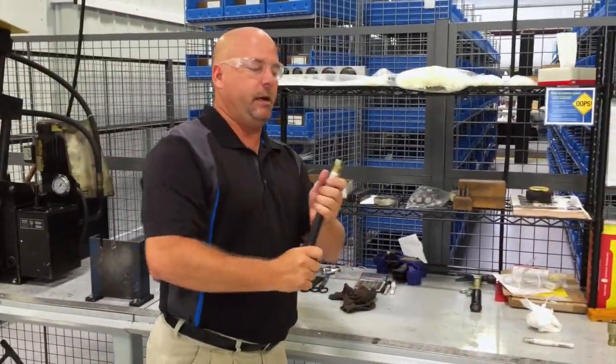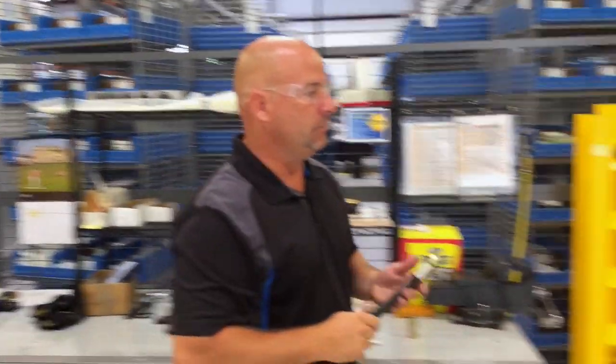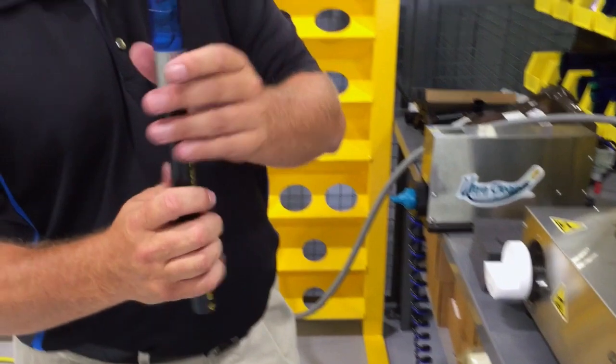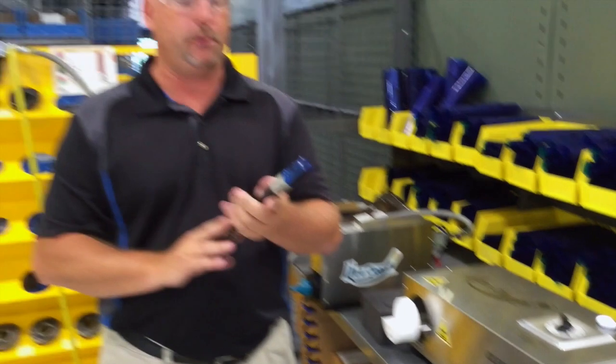In this case the crimp diameter should be between 0.945 and 0.965 because we're using a number 8 hose. The next thing we do is wipe off the end of the hose. Now you have a hose that's getting ready to go out the door, but there's one thing missing — you want to make sure it's clean. If this goes in the back of somebody's pickup truck and rolls around, and then they put it on their system, you'd have dirt going right into your system. So we use another system from Ultra Clean for capping purposes. This is a shrink-wrap cover that slides right over top of your fitting; you push it in and it shrinks down to form-fit over your fitting — it's not going to come off. Now you have a perfectly sealed cap. Do the exact same thing to the other end. It has a little strip: when you're ready to use it, pull it off, throw it in the garbage, and you're ready to go. There's your complete clean hose assembly.